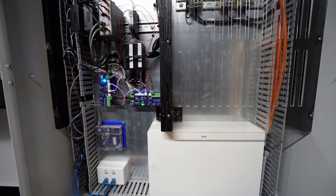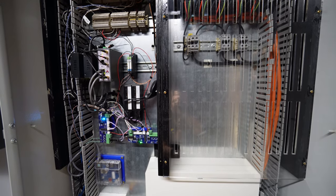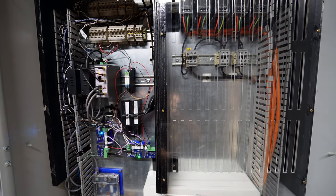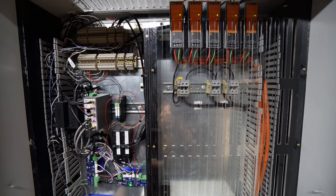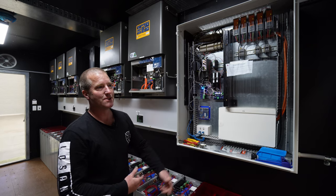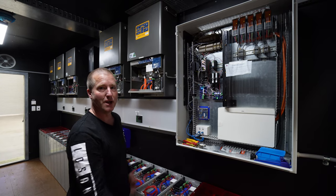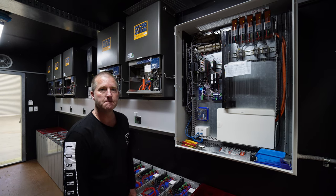And then here we've got a 4G modem that links us off-site. And at the top here, we've got five power supplies in series that produce 145 volts. So we can charge the system off the grid power to bring the batteries up in case everything went off. Like if you shifted somewhere and it got stuck in transit and eventually everything went flat, you could recover it just with a generator or a mains supply. So you've actually got multiple redundancies.